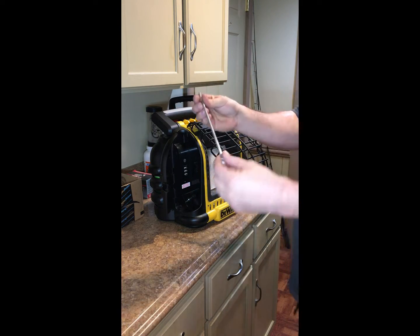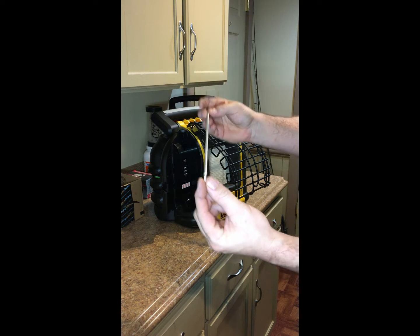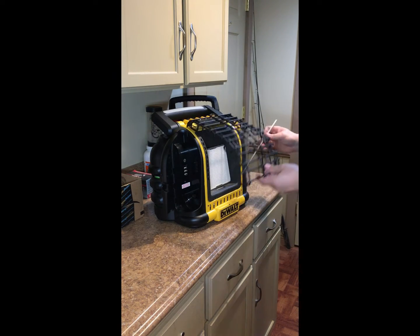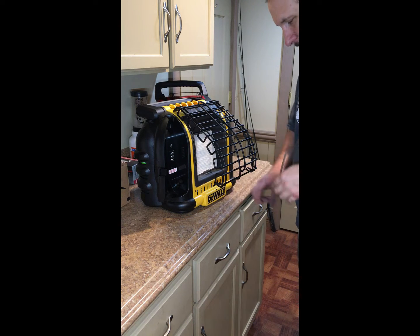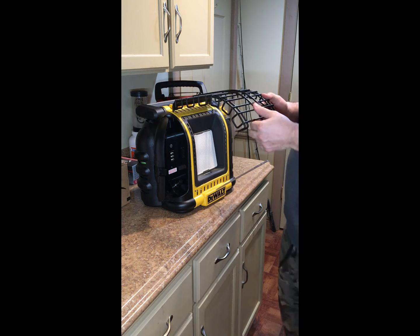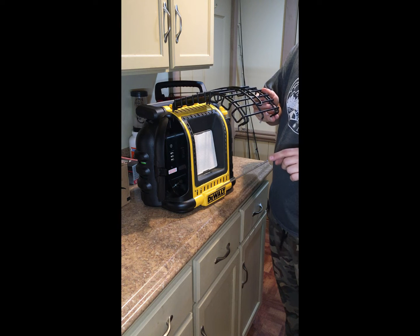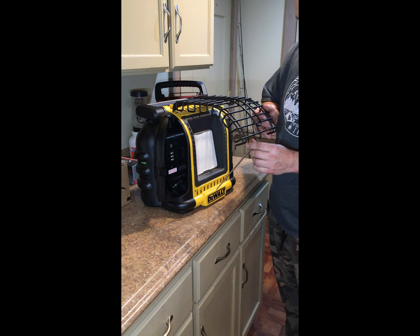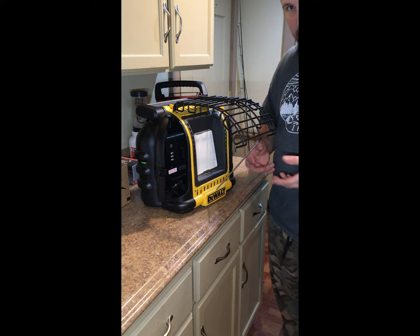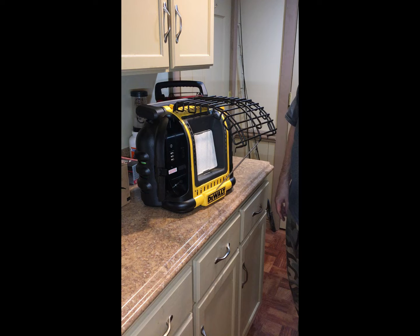Now all this rod is the middle section of an aluminum gun cleaning rod. It has the threaded part on the end here, and on this end was opened up, just a hole. So I have a little hole here on the bottom, and all this does is the threaded part drops into there. Now up top here, what I had to do is bend this out slightly and then grind it so it wasn't as thick, so that it fits in the hole in the end of the cleaning rod. Now again, if you maybe use a steel rod or maybe a bigger rod, you wouldn't have that issue if you use a bigger gun cleaning rod. This is just an old gun cleaning kit I had laying around. So that fits right in there just like that.